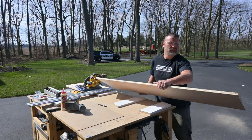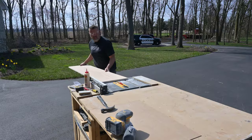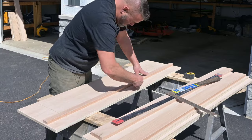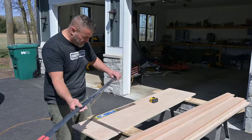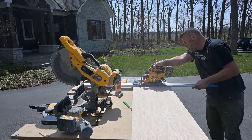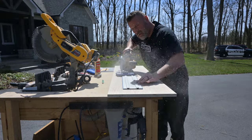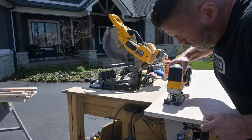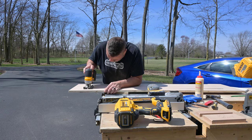There's one — three more to go. I'm going to rip the shelves down to about 15 inches. The bench I'll go as wide as I can, which will be closer to 16. Now I'm marking my bench top where I'm going to cut my bench lid out. I've got a 48-inch hinge — had a hard time finding this on Amazon, they're like $50. Home Depot is $12; Lowe's and Menards didn't have it. Jigsaw plunge cutting with a Kreg jig — not the easiest thing in the world, but we got it.